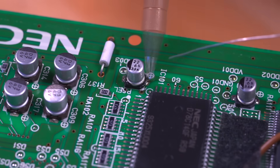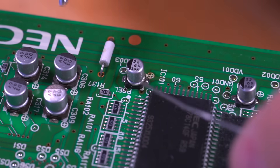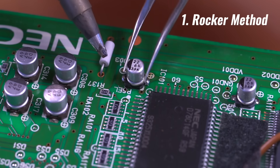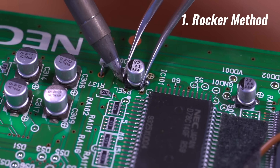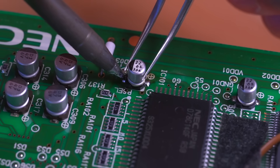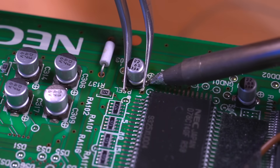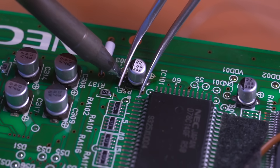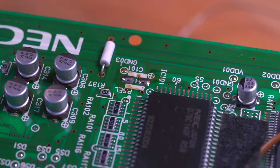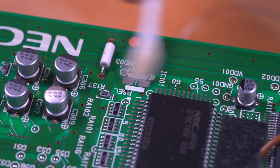To remove the capacitors, you'll want to add a good amount of flux, which will help eat up some of that corrosion and aid in their removal. You'll also want to add some fresh solder to the leads. The first method is what I call the rocker method. Heat one of the leads and then tilt the capacitor gently in the opposite direction — this will ever so slightly lift the cap's leg off the pad. Be careful not to use too much force, as you do not want to put too much pressure on the pad and risk damaging or lifting it. Then do the same on the other side, and keep alternating until the capacitor is eventually removed. The key thing to remember is to take your time, don't put too much pressure when tilting, and ensure that the solder is melted prior to tilting. Then clean the area with isopropyl alcohol, remove residual solder with some wick, and clean it again to be left with fresh pads ready to accept a brand new capacitor.